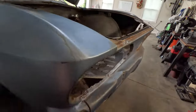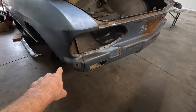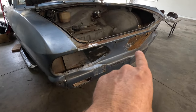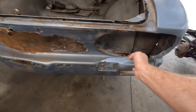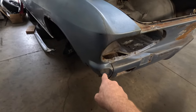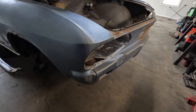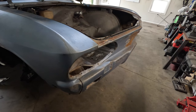I think the best place to start is actually going ahead and doing this corner down here. Rather than cutting out the front section, if I put this corner in place, I at least know that I've got a solid reference across the front. Whereas if I cut all of this off, this might get slightly off just in the course of fitting things, which is just going to exacerbate any gaps and problems. So as long as I've got a solid reference here with the nose piece, it makes the most sense to do this piece first, and then once the corners are solid, do the nose piece.